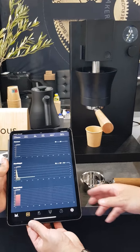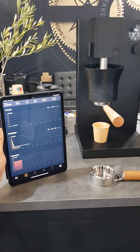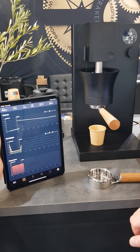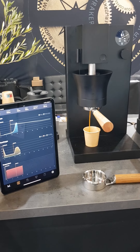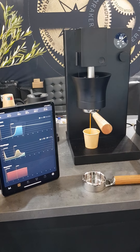I see the data already starting to track. So blue is pressure, yellow is mils per second flow, green is the weight of the shot, and red is our temperature. They're moving really quickly, but for the demonstration purpose.